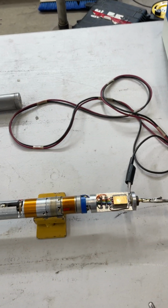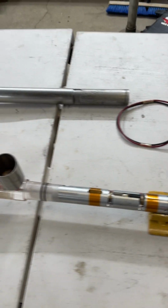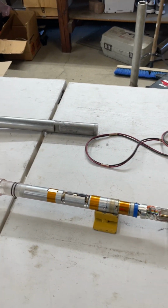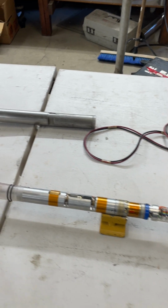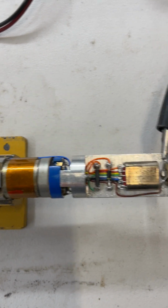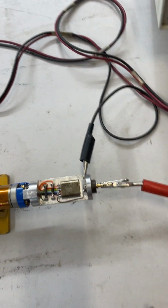These run on either positive current or negative current, and so we can run two of them in series with each other. So we would have one tool sampling when we run on positive current, one tool sampling when we run on negative current. There's a close-up of that little relay, and all the wires going into the motor, the switching circuit, the steering diode.